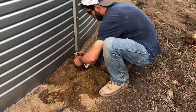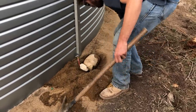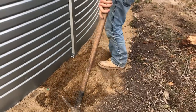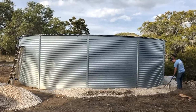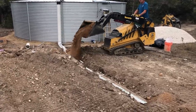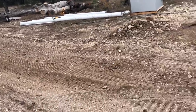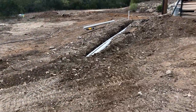To prevent corrosion to the tank, two magnesium-filled anode bags are buried around the tank — the same concept used in water heaters or buried propane tanks. Then to prevent erosion of the sand, a layer of gravel is added to the base and spread around. You can get tanks in different colors, but I absolutely love the look and color of mine. Overall it took four days to get the system complete, which I find incredible considering how much trenching my layout required and how rocky my terrain is.